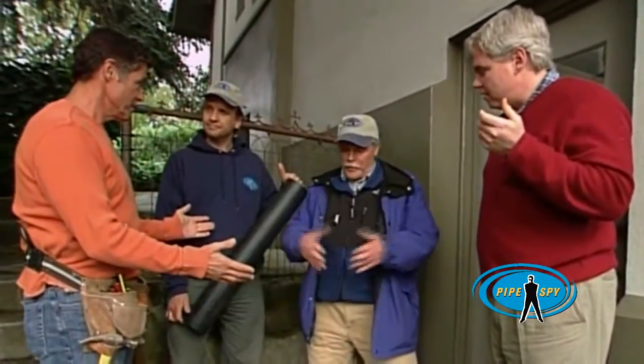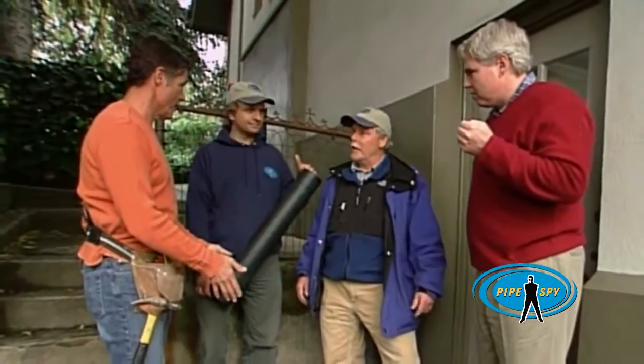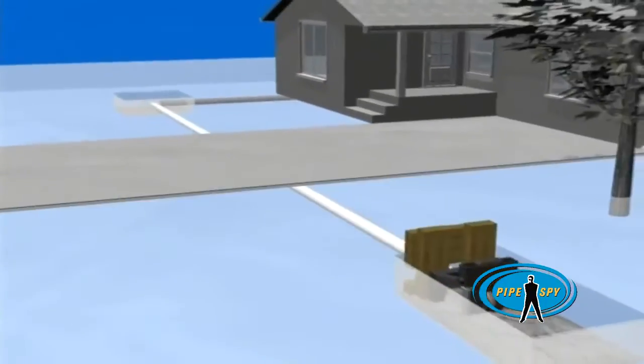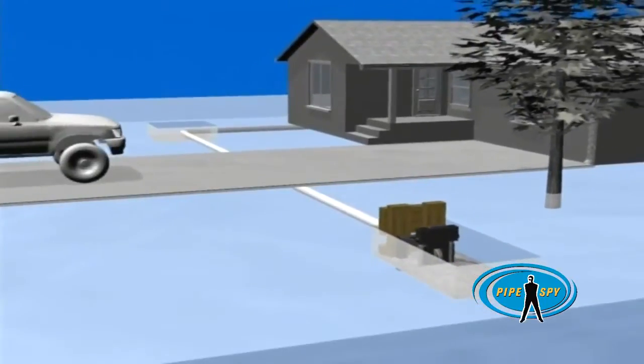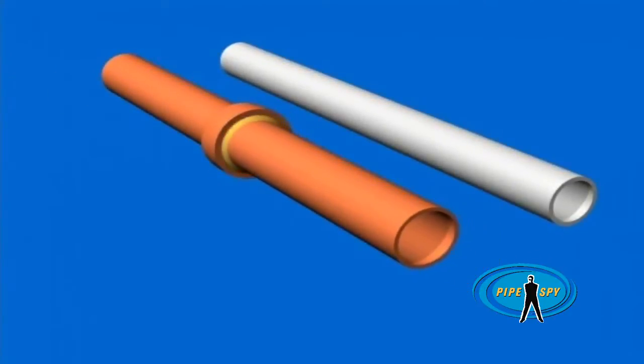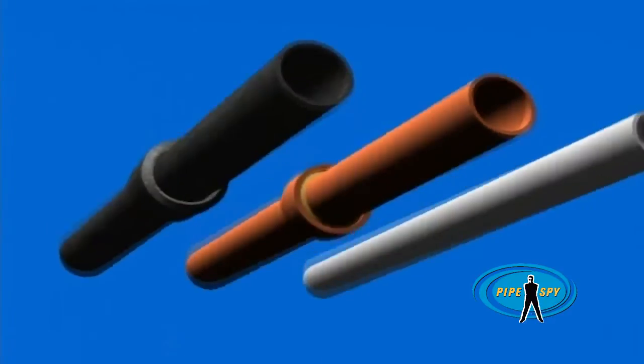All the debris stays in the ground and the new pipe is watertight. Because it's a clay pipe that's down there — in this case, yes. A new polyethylene pipe is inserted and pulled through the old clay pipe. This system eliminates the bell and spigot connections required with clay pipe and the couplings required with cast iron. Fewer connections mean less potential failure points.